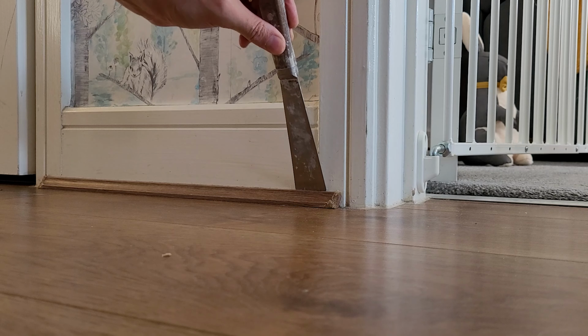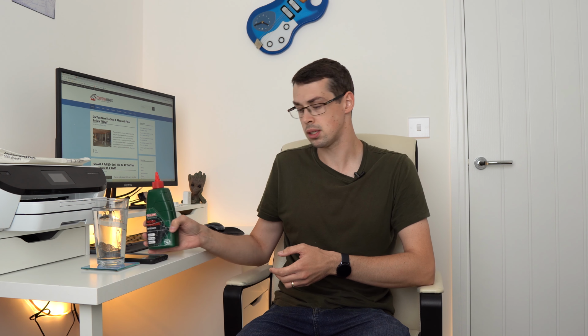When you're wanting to remove laminate moulding trim, there's two main things to actually consider. Firstly, is it stuck down with self-adhesive strips or real wood glue? And is it stuck to painted baseboards or directly onto wood, or even onto pre-primed plinths? Removing self-adhesive moulding from painted baseboards will be much easier than removing moulding stuck to wooden baseboards with proper wood glue, for example, because the bond won't be as strong in the first case.